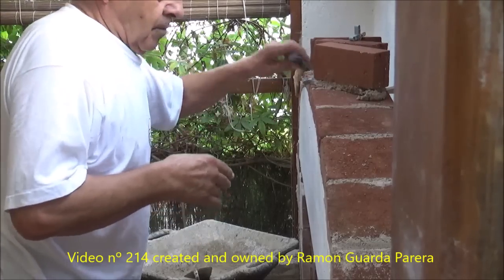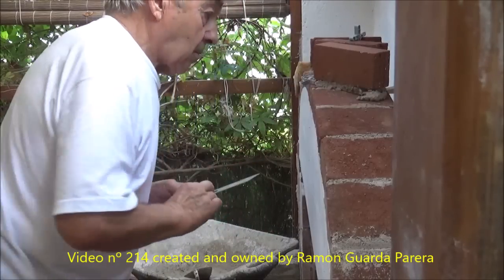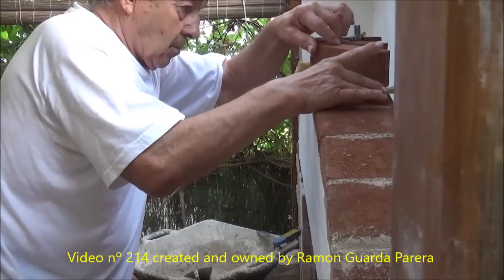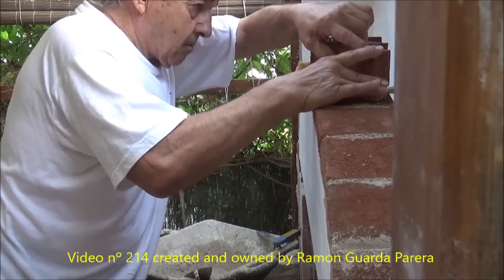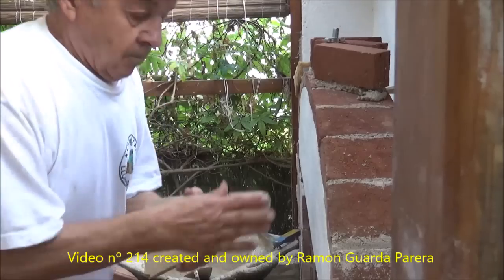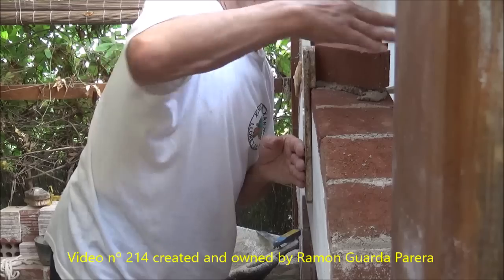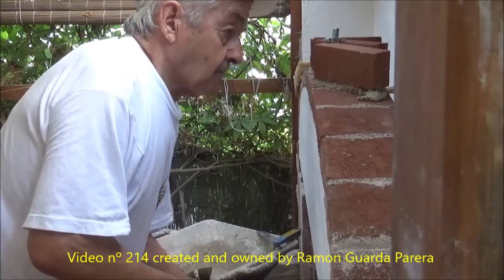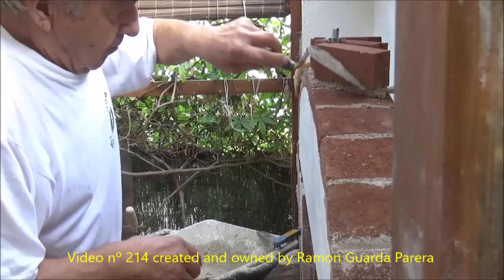It is easier to put the bricks without mortar on their side faces because in this way the joints are better appreciated. Here you can see that the back parts of the bricks have to be lowered because otherwise they would be too high. Here we cannot check the level because it is already very low. You can see how practical the protractor is. The fact that the bricks are wet allows us to move them and adjust their position. In the image you can see well the mission that this template serves.